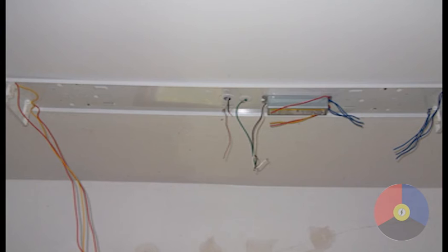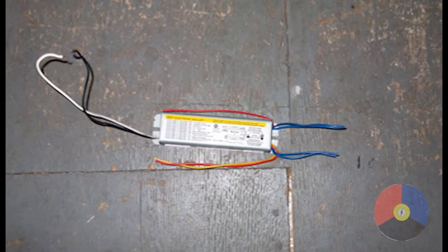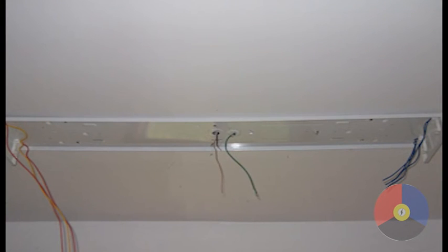And now you can disconnect all the wiring connections. The goal here is to cut the wires so the ballast is easily removed and enough wire is left over for reconnecting the incoming power supply to the tombstones. After cutting the wires, you can now remove the ballast. Ballasts are typically held into clips in the fixture with 1 or 2 screws. Remove these screws and slide out the ballast, and carefully lower it to the ground as well. At this point you now have a fixture, as shown in the photograph, that's ready for rewiring.